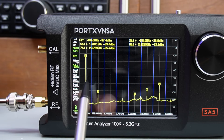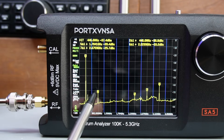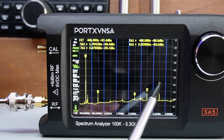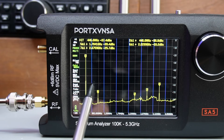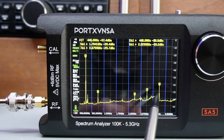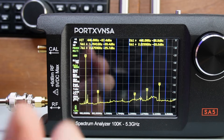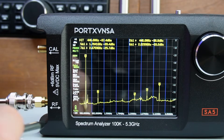We need four little squares here to drop 40 dB to pass FCC, and we've got more than that according to this. That number seven harmonic at 2.6 GHz, right in the Wi-Fi domain, is just about under. To be fair, if this reading is correct, everything else would pass. So on my testing — which I can't guarantee is right — the harmonics on 446 actually aren't too bad for once.